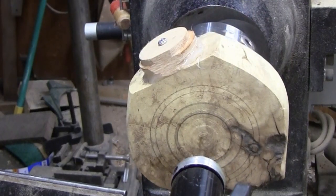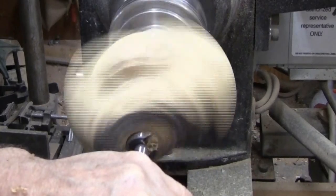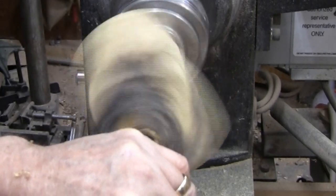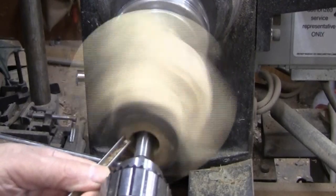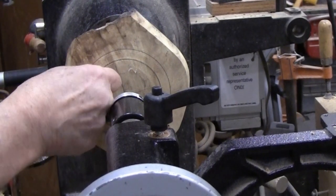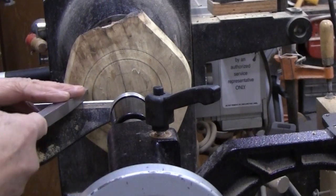Let's do that. I've got a one-inch bit in here — let's see if I can get a hole drilled in that. I left the drill bit partway in the hole just to add some strength while I took a small gouge and created an opening to make it look a little nicer than just a drilled hole. Based on the line I have on the other side, I want to start right here just to match them, although it wouldn't have to be. I think I'll just put a little cove in right here.